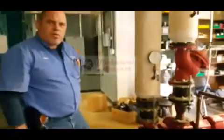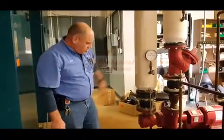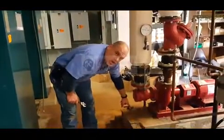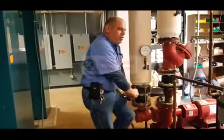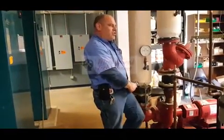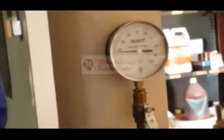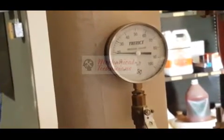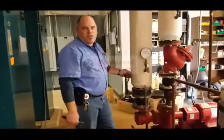When you go to open these valves, because there's an air gap here and an air gap in there, even though you open one valve, there's no way for the water to get out right away. Make sure you close your drain first. When you open it, go really slowly — you can actually hear water hissing in there and see the gauge coming up. Lots of times that gauge won't even work. Once you see it kind of stopping, then you're good to open it the rest of the way. Don't just jam it open, because you'll get bad water hammer, and that's tough on your seals.